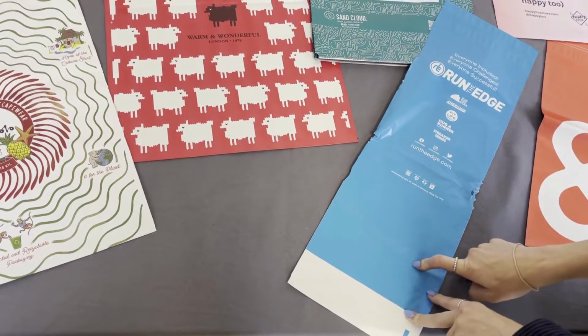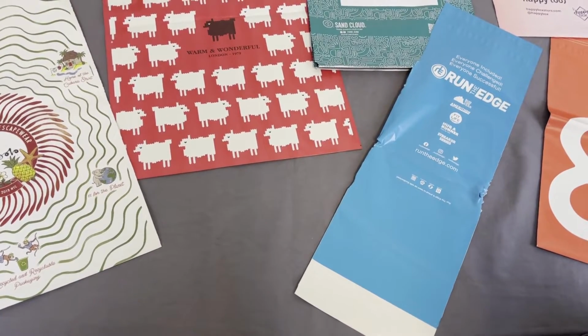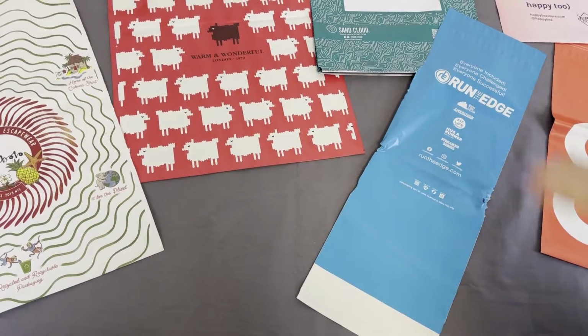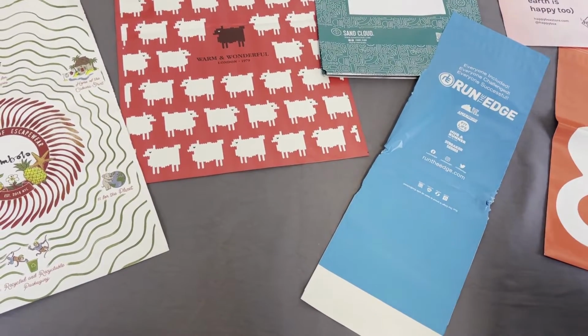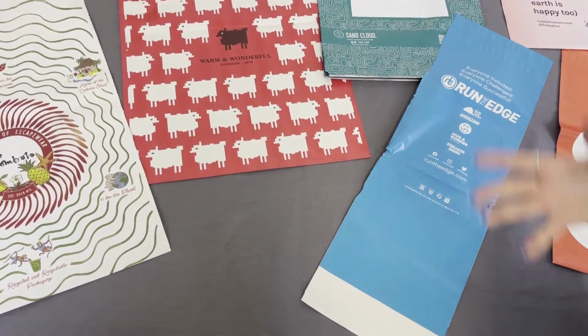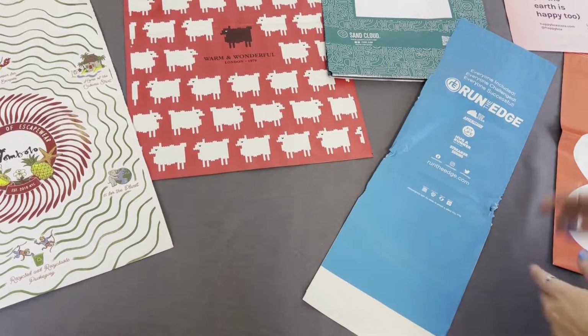And so there are a couple of different printing options when it comes to poly mailers. We focus on flexographic printing, and that is a big printing plate laying down one color of ink at a time. We can print up to 7 Pantone colors or PMS colors on these films as they're running in line.